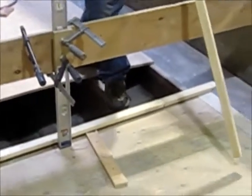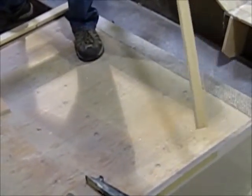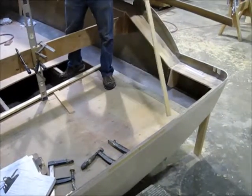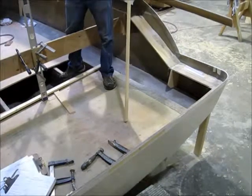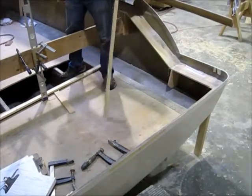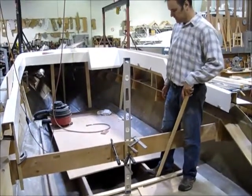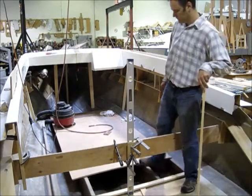Back here we have the transom wood — two layers of three-quarter inch fir plywood and one layer of half-inch fir plywood. Each sheet of wood has a layer of fiberglass in between, so each layer is isolated from one another and all glass on top. The transom wood goes in first, all sealed with fiberglass, and then the stringer system goes in. So the transom and the stringers are isolated from one another — there is no chance of water getting into the stringer or wood system as long as everything is sealed when holes are drilled and screws inserted.